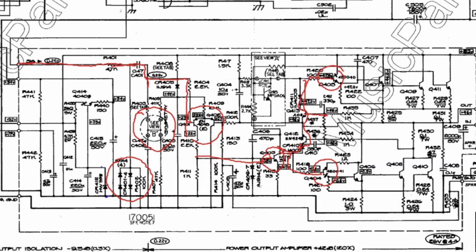This is another driver transistor. This is the one that was burning out before. Nope, comes through here, and then drives those. One of the ones drives the other two big ones, and the big ones here and here are then doing the push-pull through here. And yeah, so let's take a look at that. So let's find this guy right here and see what kind of a signal we have coming in.